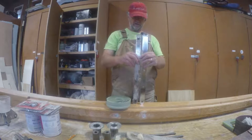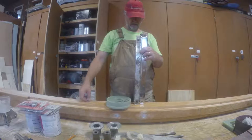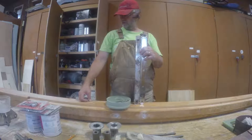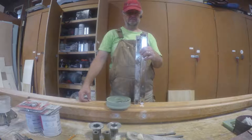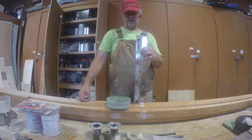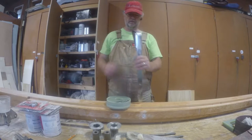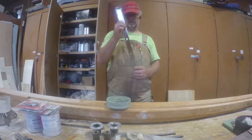One of the first things I discovered was that the holes don't line up. The new one was made according to the plan, and I'm not sure how or why the old one was made the way it was, but the holes aren't going to line up. I've been fighting with drilling holes long enough, so I'm not going to fight with it. What I'm going to do is fill the holes on the stem of the boat with epoxy, and when the time comes to mount the bowsprit, I'll use this as a template for the new holes and drill them through it.